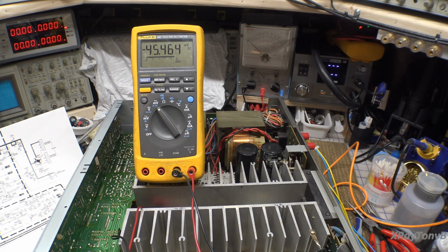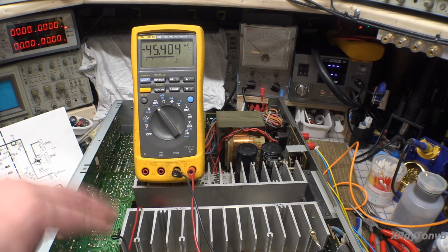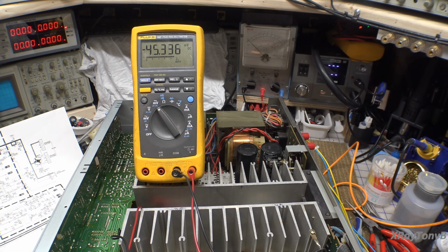That's what they're in there for. In a perfect world, if you had 4 perfectly matched perfect transistors, you could essentially eliminate those emitter resistors, and the amp would idle perfectly. It would give you a higher damping factor, and it would allow more current to get to the speakers. And a lot of people would say that would give you better bass response and so forth. But this is not a perfect world. Transistors are not perfectly matched, and therefore that's why we have those.